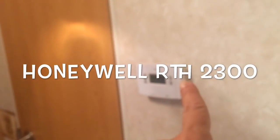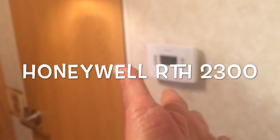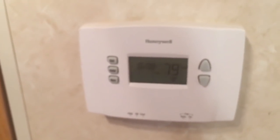So that's how you convert a Honeywell Home $19 thermostat to an RV. That's your wiring. The only wires that stay in normal are the white and the yellow. White's your heat, yellow is your air. The blue and the orange double up. That's your high and low fan, so it can adjust itself for cooling. And then the black goes into the RC.